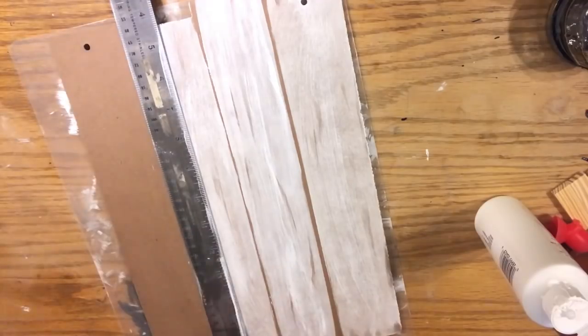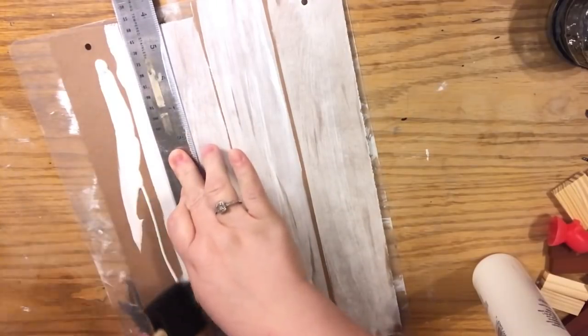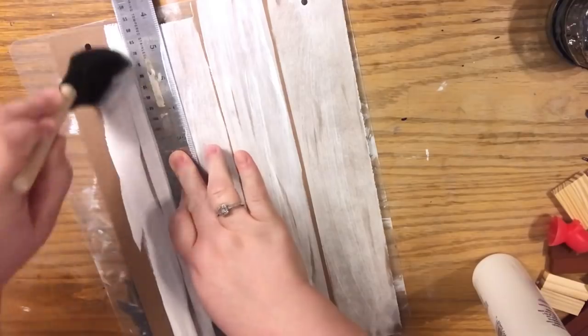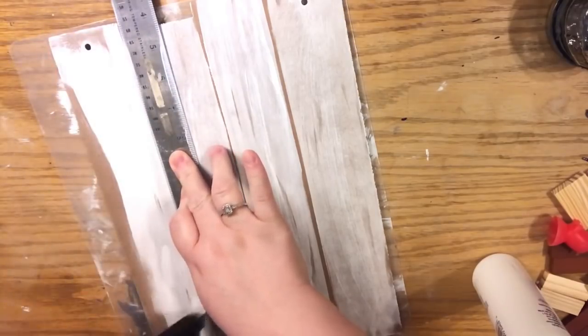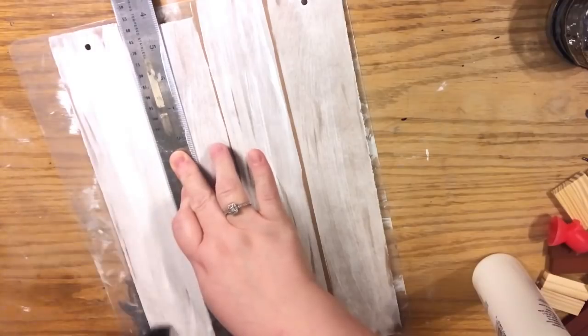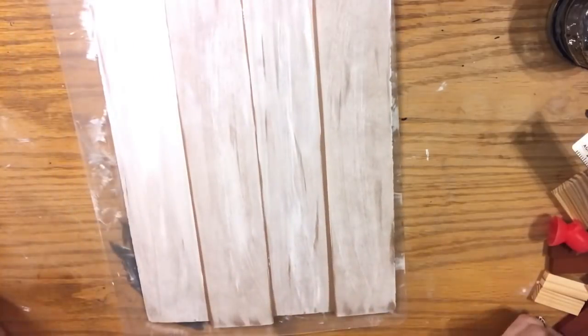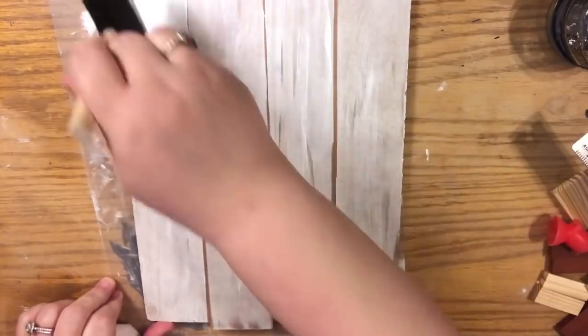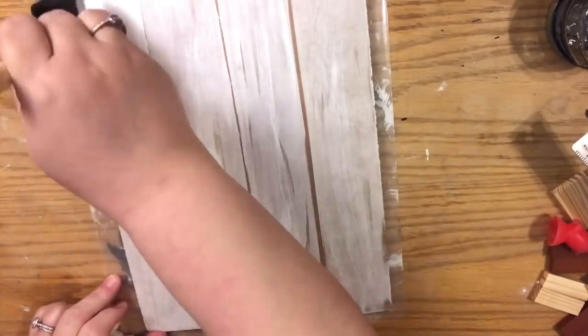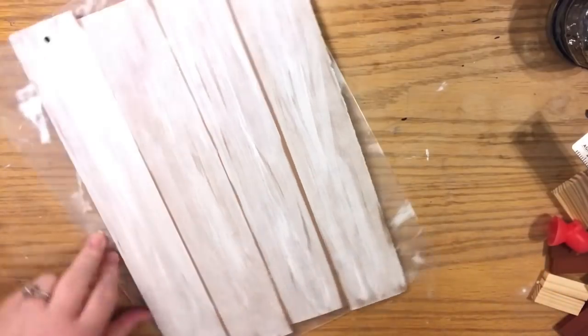When it comes to the last board, I'm going to make a mistake and show you how to fix it. I did put too much paint on there, so I'm going to show you how to recover. I'll brush it off and then use the edge of the brush to really push into the paint, trying to get some of the excess off and create the striations that make it look more like barn board. I've spread that paint around — taken it off the last board and put it over on the first board — to create more depth of weathered wood grain.